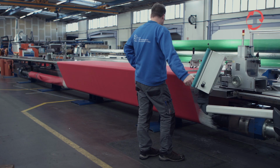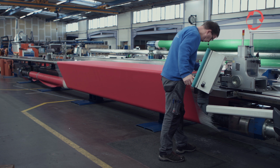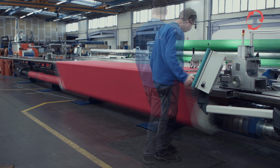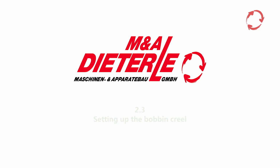When rewinding, the right edge of the sieve must be precisely aligned with the right edge of the table across the entire length, so the sieve edge always maintains the same distance from the filling template during the filling process. The sieve is now in the start position for the filling process.